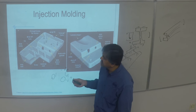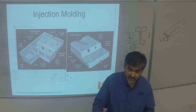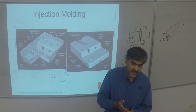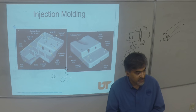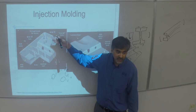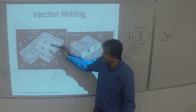These features — steps, snap fits, and plastic hinges — are very common in plastic parts. A lunchbox is a good example of a plastic hinge — it has enough ductility in the joint to take many fatigue cycles of opening and closing. Snap fits are probably more readily incorporated in injection molding because you don't have to weld them later. In metals, this would be very hard to integrate, requiring a lot of post-welding.